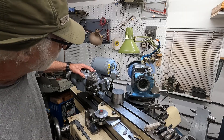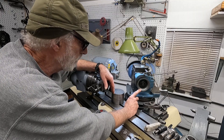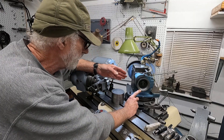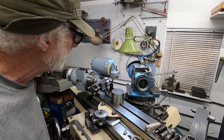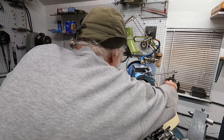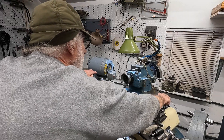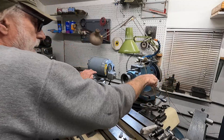This wheel is a three and three-quarter inch — it's a lower concentration wheel. Another guy got me onto this if you want to grind carbide kind of fast. So I'm going to set the wheel head at about three-quarter degree. There it is. Okay, snug that.